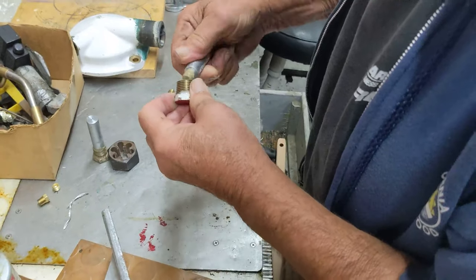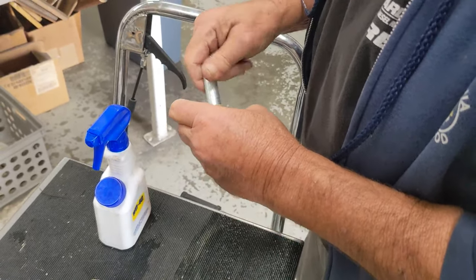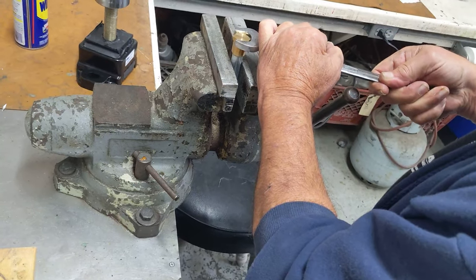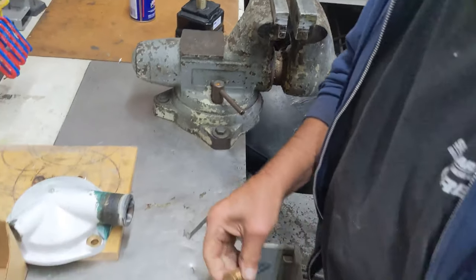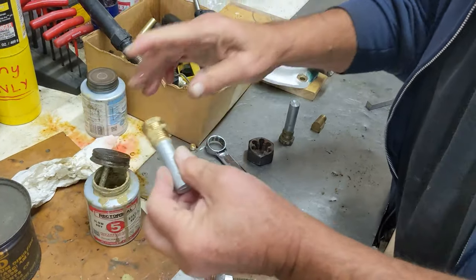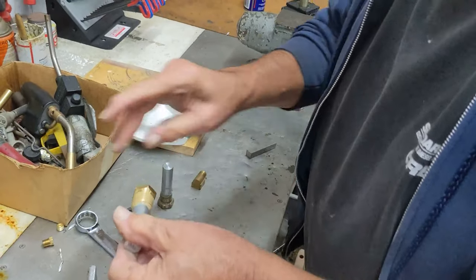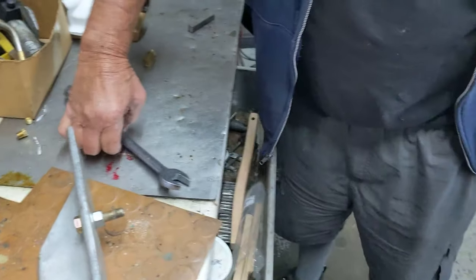I think you got the wrong cap. How tight do you make it? Just a tiny bit beyond hand tight, right? Yeah. Real easy to break them. That's pretty good right there. The biggest key to the zinc is put it in with pipe dope, so you get a good contact and it doesn't leak. People think that putting an insulation or sealant there is going to make it not connect. It's actually the opposite. It makes for a better connection.